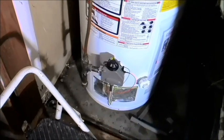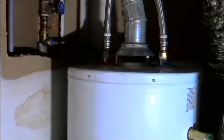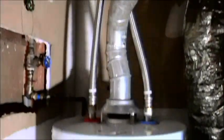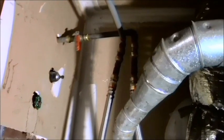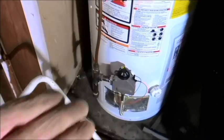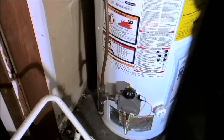I have turned on the valve, checking for leaks. No leaks so far. It's going to take probably about 5 to 8 minutes to fill up this tank completely. That's at a point where you have water pressure going on, and you're going to check for leaks when it's full. But then you're going to kick up the burner. And once the burner starts, now you have heat pressure and the water pressure, and that's when you want to check things also. Another thing I used to do back in the day, I'm not suggesting that you do this.